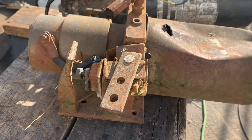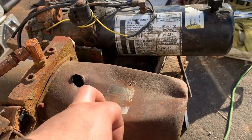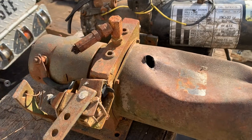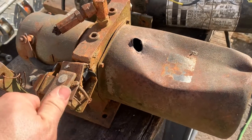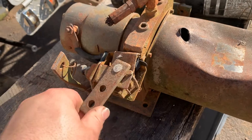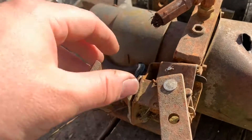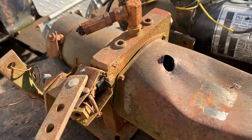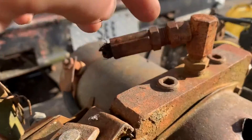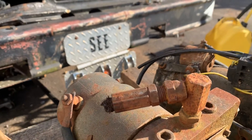This is the one that he said he used on this particular dump bed, and as you can tell it's smashed and I'm guessing there's probably water in here in addition to hydraulic fluid, so that may have rust in it. It's hooked up with this pull style dump mechanism. I don't necessarily have a problem with that but I've never used one before. It also already has a mounting bracket on it. And this hydraulic line is either bent — they just don't like to bend without cracking, so that makes me a little skeptical.